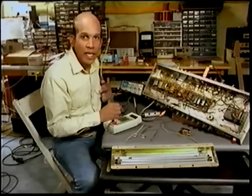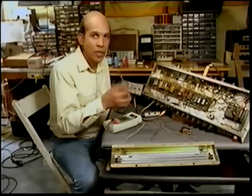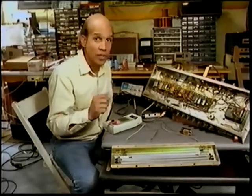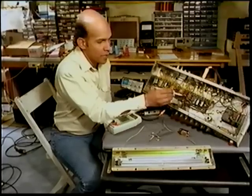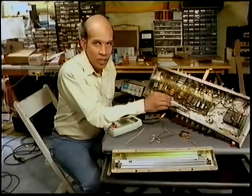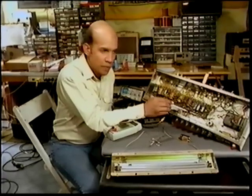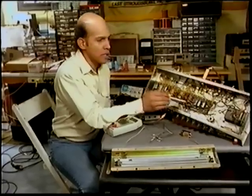If you don't see the light blinking, chances are that the photocell is bad. In that case, you will have to replace one. You can always call me to get one. Move all parts around. Make sure that everything is connected. Check all solder joints. Check your grounds. It's always a real good idea that the first inspection should be in the ground straps.